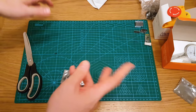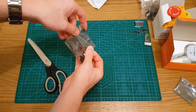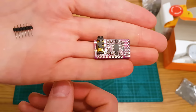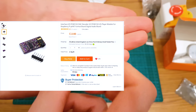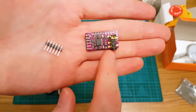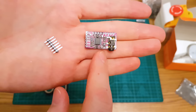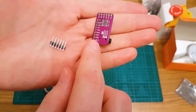This is some kind of audio module — it's an I2S PCM5102A, basically an audio board. It runs off the I2S protocol and it's for embedded controllers that don't have any audio on board. A good example is the Raspberry Pi Zero. If you want audio out of that device, you can hook one of these up via the I2S protocol and it will come out of this headphone jack. You can also hook it up to an amplifier, and you've got your left and right out.